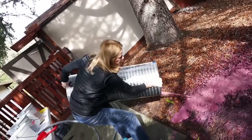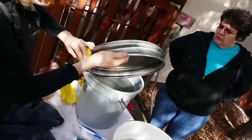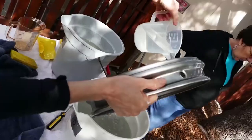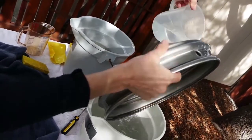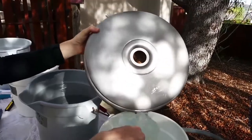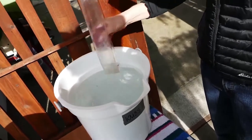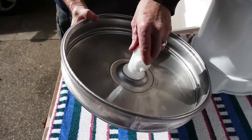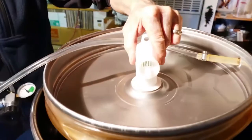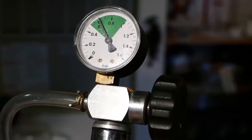As you can see, this is what's left in the giving tank. This tank goes through a sanitation line: chlorinated trisodium phosphate with a water rinse, then a dilute citric acid with a water rinse, and finally everything gets a small concentrated potassium metabisulfite dip just to assure sterility. Fill your new tank, replace the lid, pressurize, and you're ready to go.